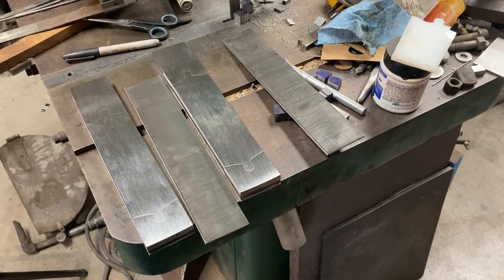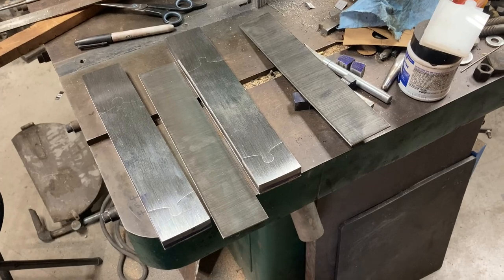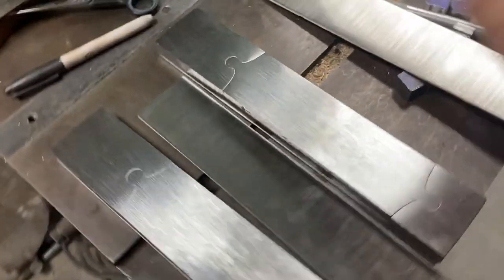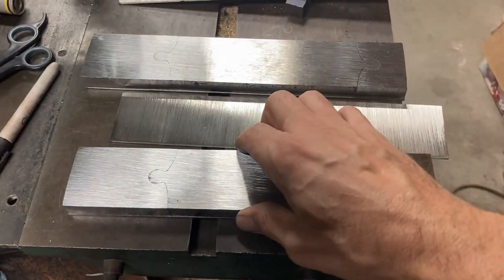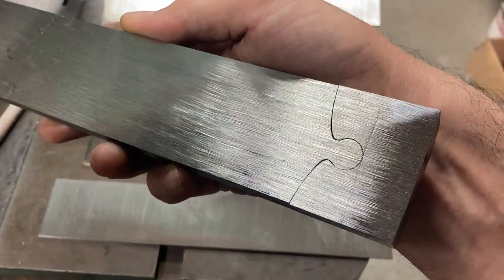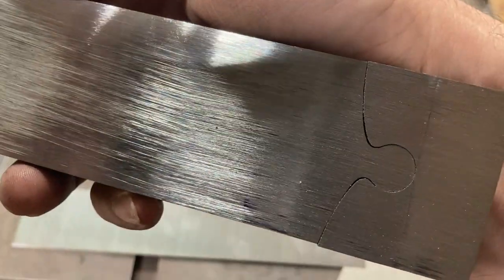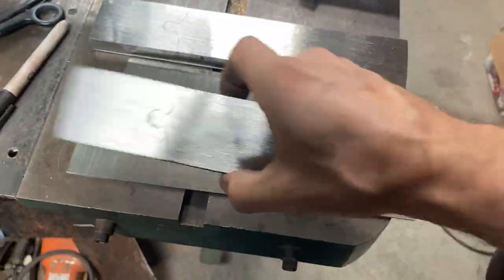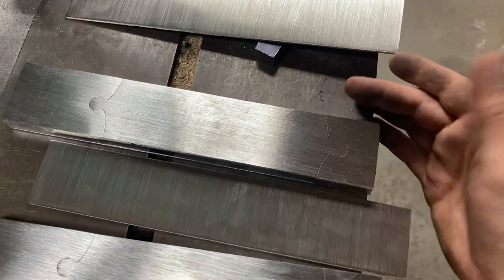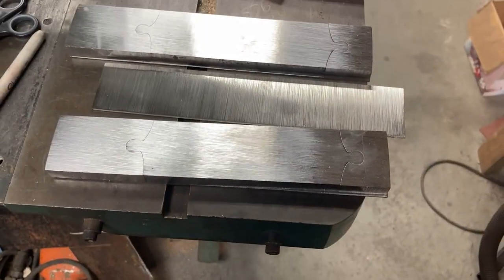Well, I've done a bunch of work off camera. And I fitted the one up by pantograph. And I fitted the second one up by just scribing the female onto what would be the male part and then just fitting it by hand, grinding it. You can see it's not perfect, but it still presses on. And then since that worked, I did the other bar on both ends. So now I have two double keyhole